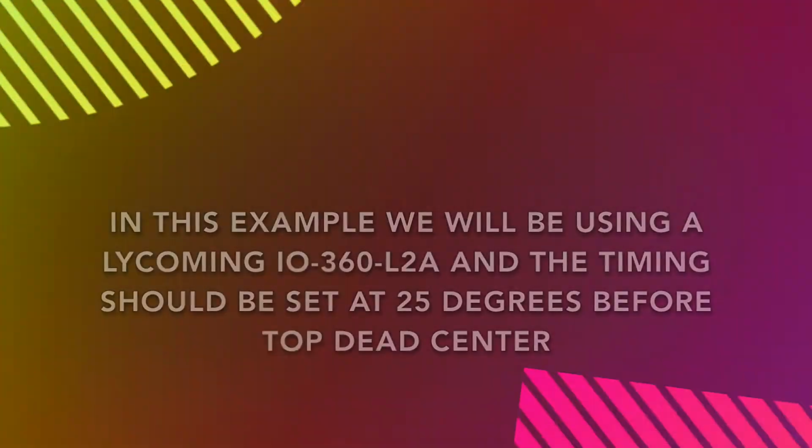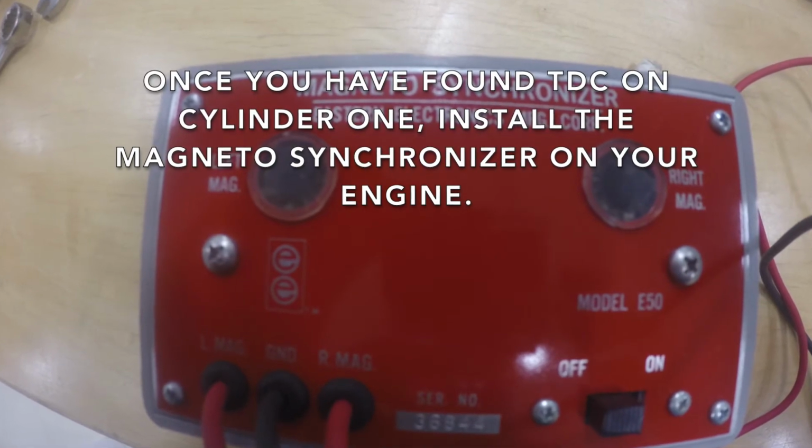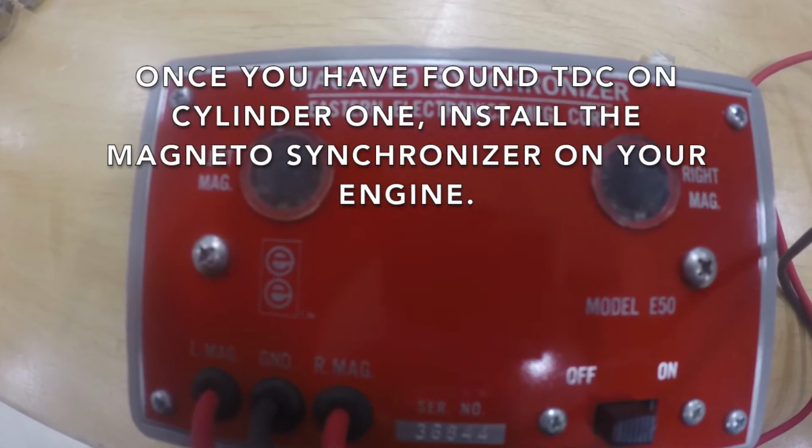In this example, we will be using a Lycoming IO360 L2A, and the timing should be set at 25 degrees before top dead center. This means at 25 degrees before top dead center, the points in the magneto should just begin to open. Once you have found top dead center on cylinder 1, install the magneto synchronizer on your engine.